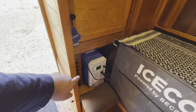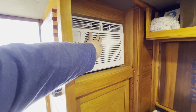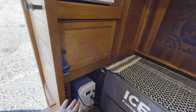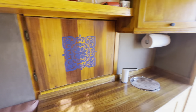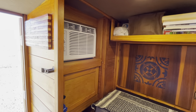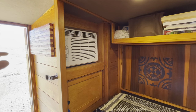I haven't tested it in full real-life conditions yet, but my anecdotes are that I can run this AC unit three to four hours on a single charge of the solar generator. With 400 watts of solar, this AC unit only draws about 400 to 450 watts, so I could almost run it continuously in ideal solar conditions during the day while maintaining a charge on the solar generator. In a small space like this, a 5000 BTU unit probably won't need to run continuously to stay cool — so there is a way to have off-grid AC.